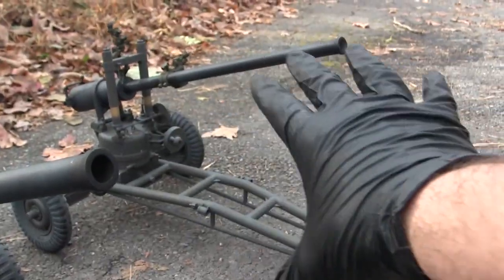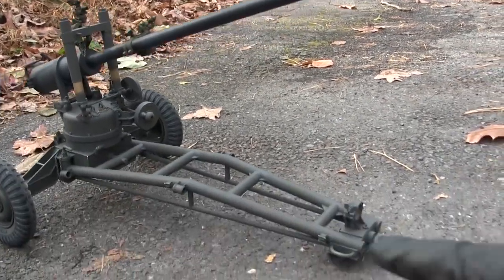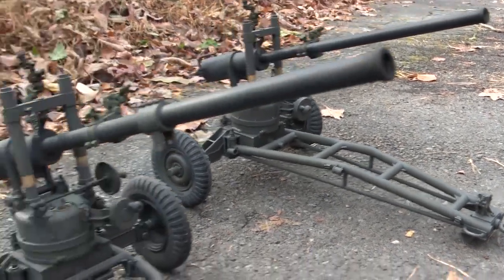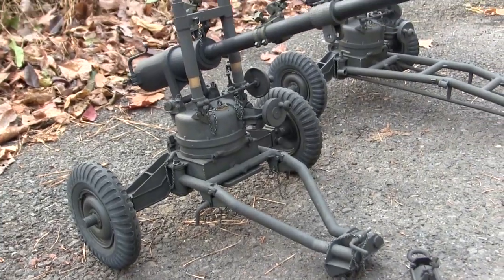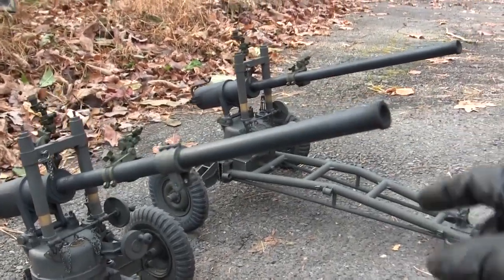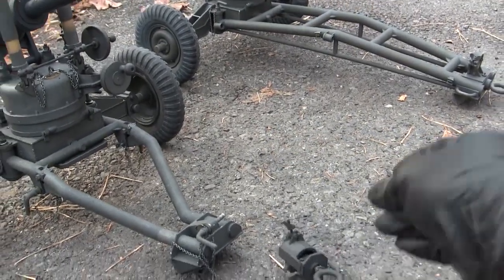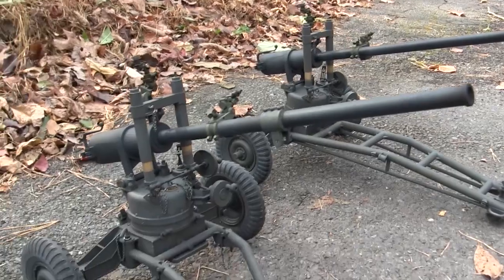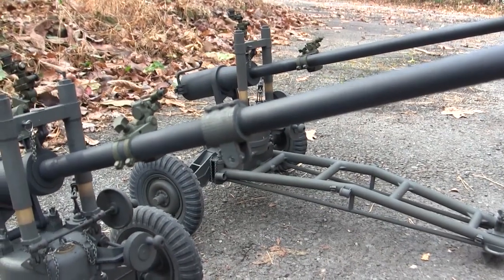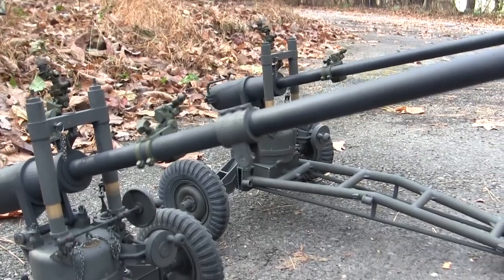The unit that we have here is much more simple in that the gun itself has absolutely no modifications made to it. However, with the long section that we have here, it does make the unit a lot more cumbersome compared to the lower profile short trail counterpart. But with this system here, you have an extra unit clamped onto the barrel, and then there's also the risk of the rifling getting damaged from the lunette that needs to be mounted towards the barrel section. And if I'm not mistaken, I believe that the sleeve here can possibly cause accuracy issues, but this is something that's really more of a hunch and not something that I've seen actually documented.